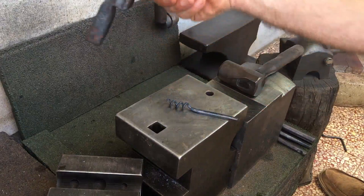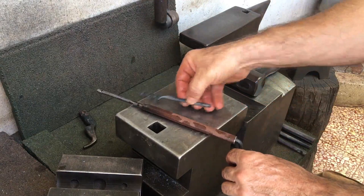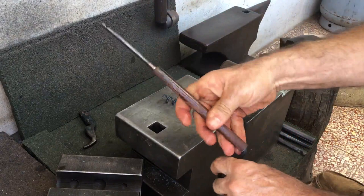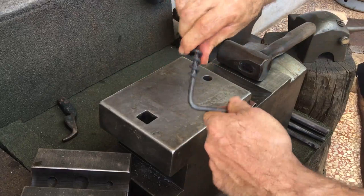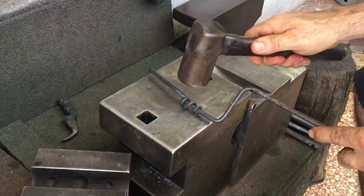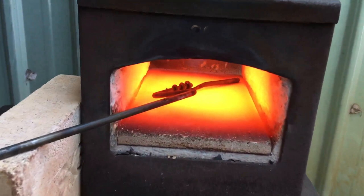This can definitely help you save some time with fiddling around making the screws. So as I'm sitting here looking at this, I think, hey, I can use the handle end of this jig to get even more consistency. And I wouldn't need my anvil bick to close the last turn. And if the rod you use for the jig is too wide of a diameter, you can later use a smaller diameter rod in this manner.